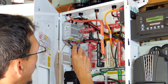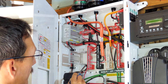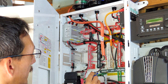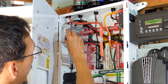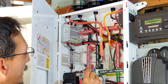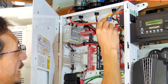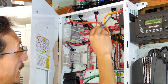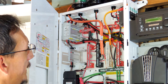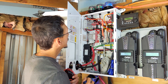This is PV1 and PV2 positive. This is the AC in — leg 1, leg 2, and common — so you can bring in 220, which I'm doing. This is a 220 line. And then this is the common again for AC out, and then leg 1, leg 2 — so you can send 220 out. I'm only sending 120 out to our load panel which runs the house, because that's all we need. Later I could add another leg and push 220, which is cool.